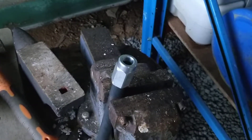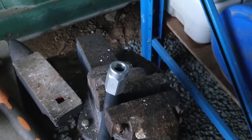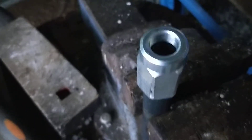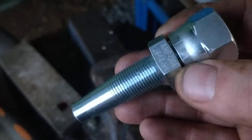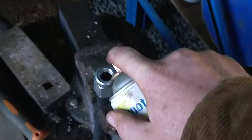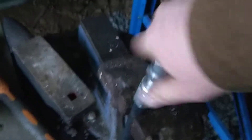This will make it easier when you put the insert into the ferrule. Otherwise it's much, much harder to put in for no extra gain. So you've screwed that all the way in, and you've backed it off half a turn. Now we want to add our fitting in. The other tip is to add some oil in there to lubricate it — a little hydraulic oil, or in this case I'm cheating and just using a little bit of lanolin. Just to make it much easier to put in. And then this is a normal right-hand thread.